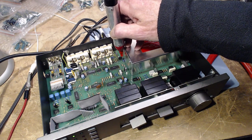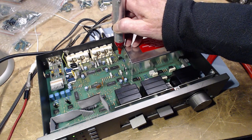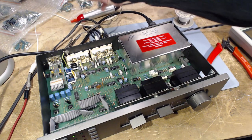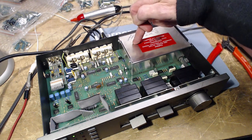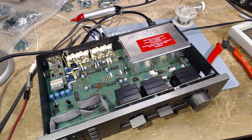Good luck to me, but I think it could be as simple as one of these transistors has failed, right in here. So that's what I'm going to do. I feel a lot better about doing this than just shotgunning capacitors. Shotgunning capacitors is risky business, for sure. A little bit of signal tracing - here's what I found. The balance control is right here. These are the terminals for the balance control. These two capacitors, C48 and C54, are the feeds to the balance control.